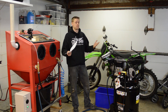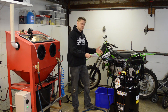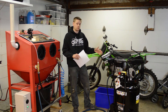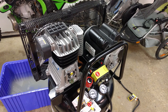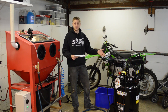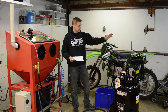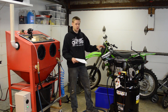My answer was yes because more power is always better. But I wanted to see if I can blast with a small compressor like this. The short answer is yes, however it does take longer and this thing will run the whole time you blast. What we have here is the Harbor Freight 61489 29-gallon vertical compressor. It has 5.9 CFM at 90 PSI, 7.3 CFM at 40 PSI, and it costs $329 with a coupon. It has a two-horsepower motor — that's all you're going to get on 120-volt — and it's belt-driven with a lubricated pump.